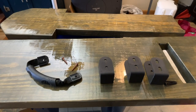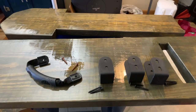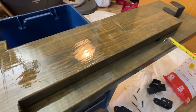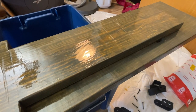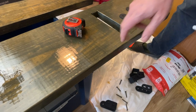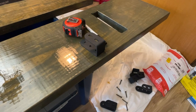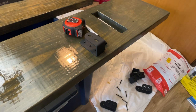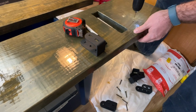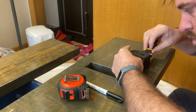Now the idea is for this to be completely transportable, so we want to add a handle to one side and a method of attaching things. To make this chair more transportable we want to make sure the seat is affixed to the back, so we're going to be using barricade brackets to hold everything in place. The bottom portion of the seat is two inches narrower than the actual backrest, so we're going to go about an inch and three-quarters, allowing about a half inch total space for this to slide in and out with ease. Instead of using a pencil and gouging it, I'm going to use a dry erase marker to mark the center of the holes. We're using three brackets — two to hold it in place and the last one at the bottom to ensure there's no unneeded stress on the wood or the brackets while carrying it.